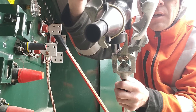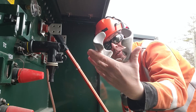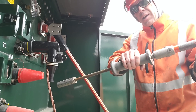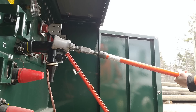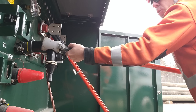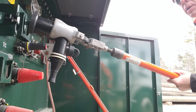That hook right there hooks into that elbow just like that, and then you simply turn the stick — that's going to grab around the body of the elbow. Then you have this weight that probably weighs a good five pounds, and you simply hammer that to remove the elbow. This can all be done with one man. You simply hammer that until the elbow comes off, and then you are able to park it on the parking stand.